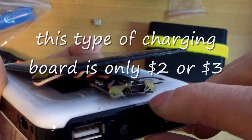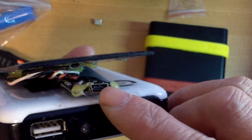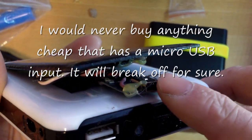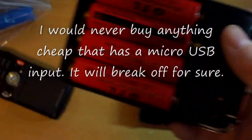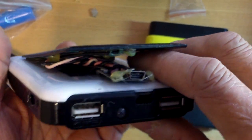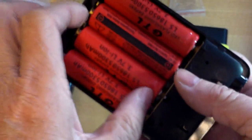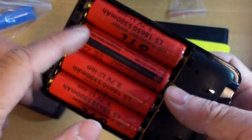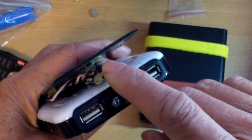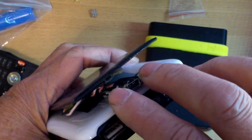Because if you can't charge it, what are you going to do with it? So what I did was I put in a lithium-ion charging board — I used one that came with a mini USB receptacle instead of the micro USB. This is quite a bit sturdier. I connected the charging board's positive and negative output to the positive and negative rail, ran a wire inside and soldered it on. Now I can plug in my USB charger here to charge it.